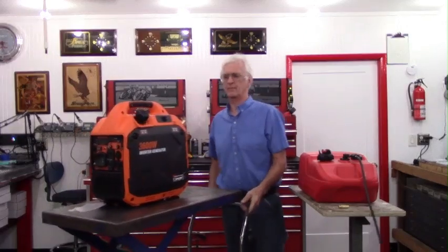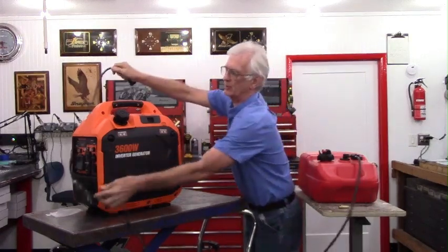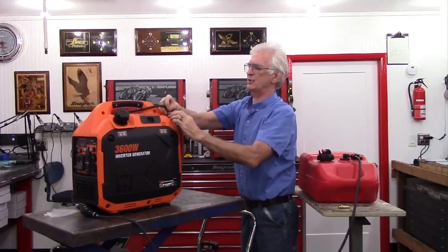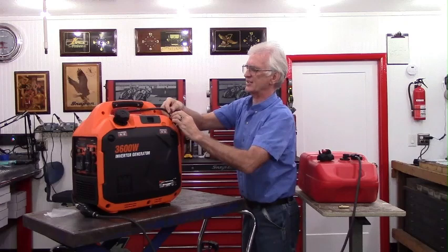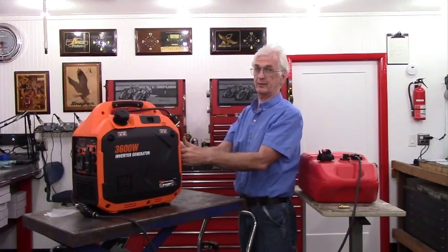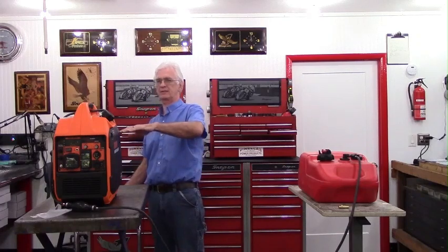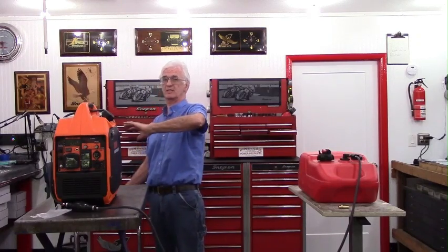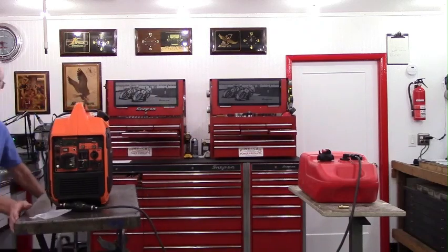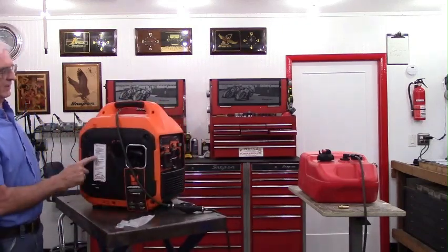On the generator, I have the fuel inlet port right here. In order to be safe, run the fuel hose around the front of the generator, under the handle, and then snap it on. The reason I say to do it this way is because gasoline is flammable — and I don't want the fuel hose hanging down or having any possibility of hanging in front of the exhaust, which is blowing out hot exhaust gases. If you are running off the stock tank, you'll run it exactly as before without any changes. If you're running it on my remote tank, there's a decal right here that explains the steps.